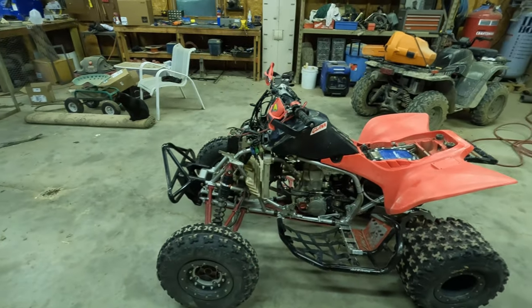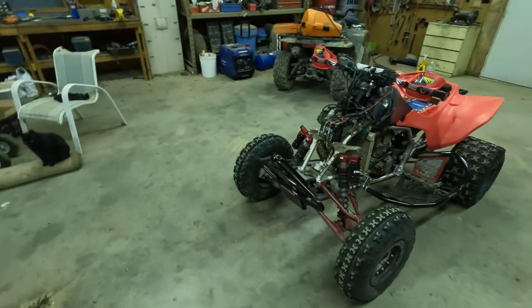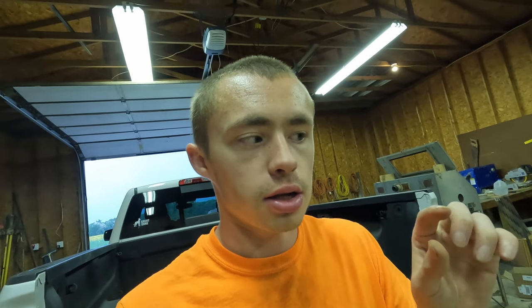Okay, guys, well, as you saw, the old 450 is starting pretty dang good now. So I think we've got her good and dialed in. The valves are within adjustment. However, after I talked to you, I went to put this thing back together, and unfortunately, the one intake valve that a feeler gauge wouldn't even go inside, I had to adjust it two different times.